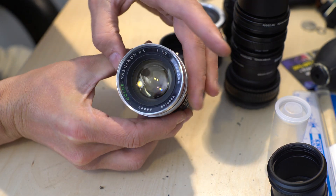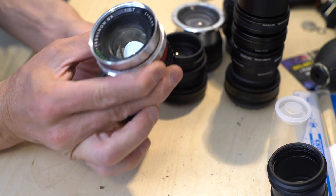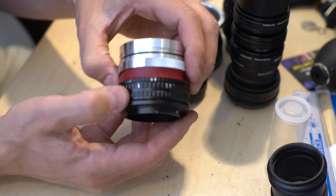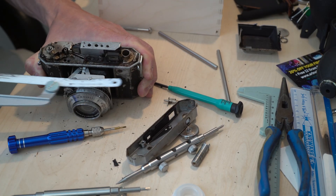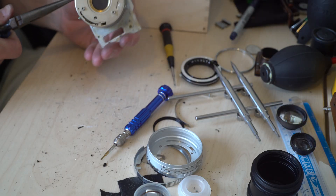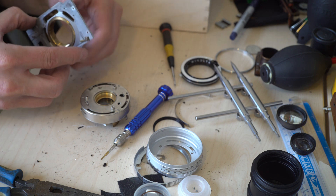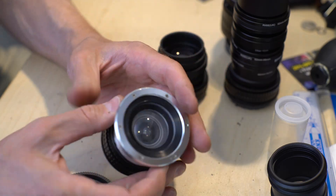That's all well and good, but if you just want to make something usable and not learn all this optical engineering stuff — okay, we can do that. First rule for what I'm about to show you: never use a repairable or good camera. Use a camera with extensive rust, bad electronics, or a missing film door that can't be replaced. Buy a parts rangefinder on eBay for this. Seriously, don't destroy a good camera for this project. Recovering a dead camera's lens can either go well or terribly — there's really no in-between. I've had it go both ways, and with some rangefinder makers the lenses completely fall apart because the housing for the lens was integral to the camera body. So this process is at your own risk, and you should expect to fail and ruin the lens you are trying to harvest as often or more than you succeed. A fun place to start is a dead Lomography fisheye or La Sardina. These lenses have complete housings and can be removed easily, or at worst with a small handsaw and some anger.